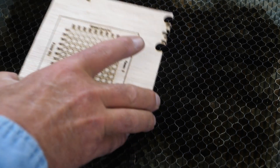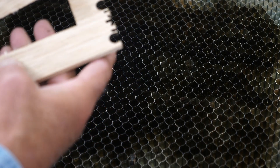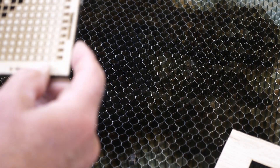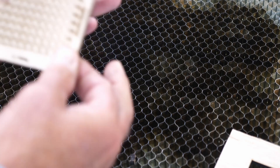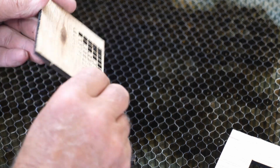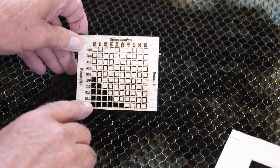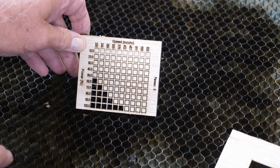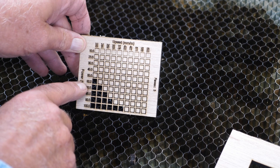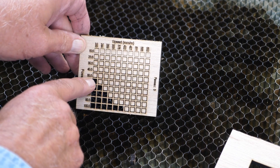We'll take a look at what we've got here. There were a couple little places that didn't quite cut all the way through on the border cut. When you do this, just kind of give it a little tap. On the back side, there are some that almost cut through but didn't quite - those are not the ones you want to use for settings. Looking at this, it's quarter inch plywood, three passes. At 60 percent power and 200 millimeters per minute, three passes give a good cut.